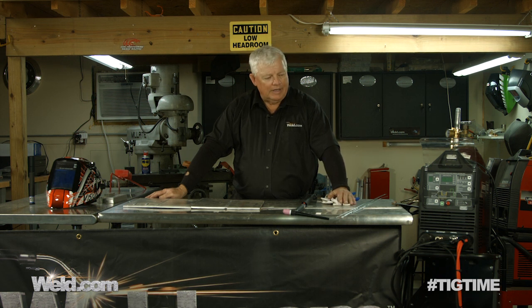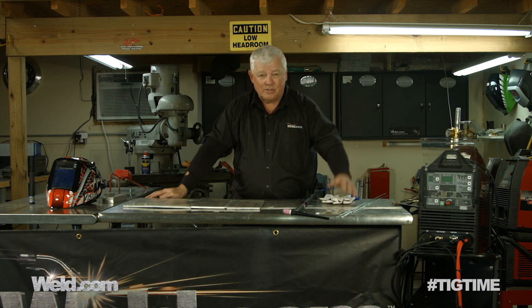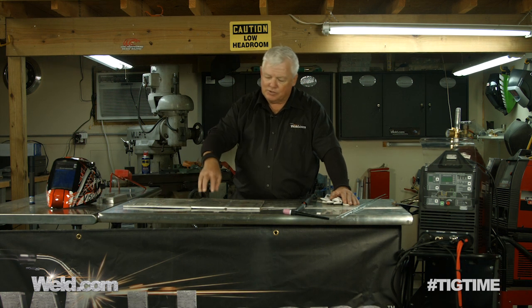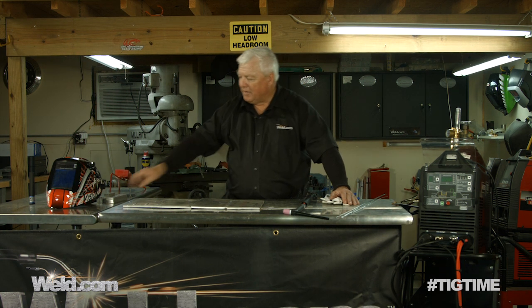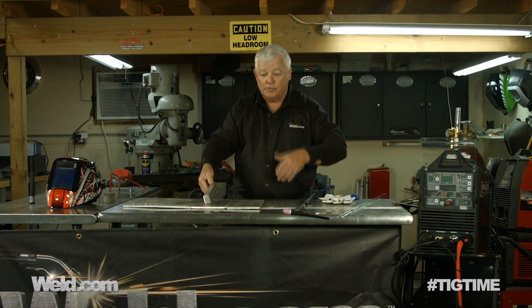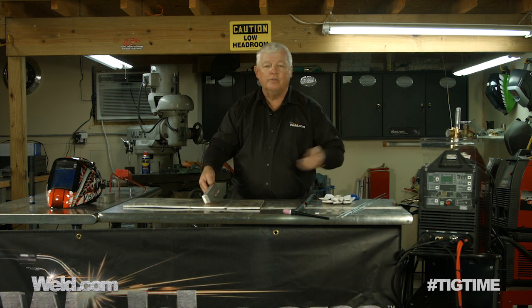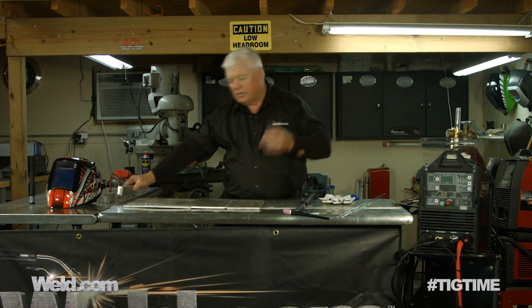The second part of this is going to be on primary aluminum and I'm going to do heavy, heavy, heavy aluminum. The fact that this goes up to 300 plus amps — I'm going to test out some 3/8 inch aluminum and then I'm going to put on an inch and a half thick bar and do some fillet welds as well as bead on plate. I want to do some long runs so I can get a good feel for the machine.